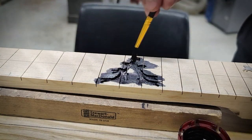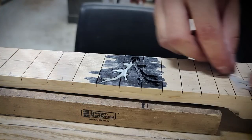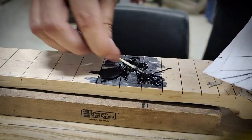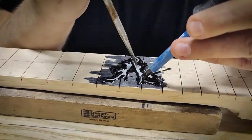I'm applying a small amount of black stain so it has a chance to permeate the wood around the pocket and not get blocked by the glue I'll use for the inlay. I mixed two-part epoxy glue with black pigment. Epoxy is preferred here because it fills the area around it and doesn't shrink while drying.